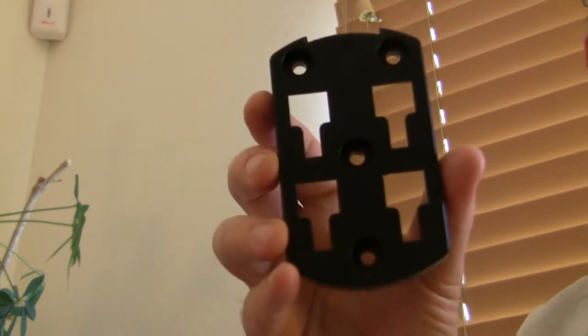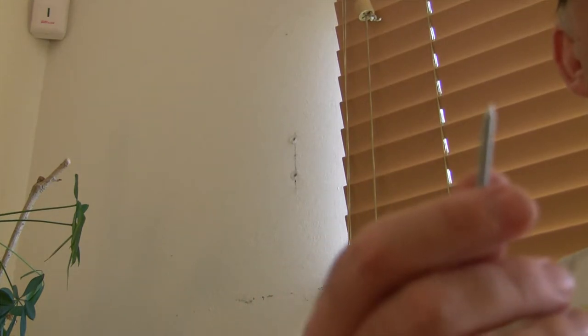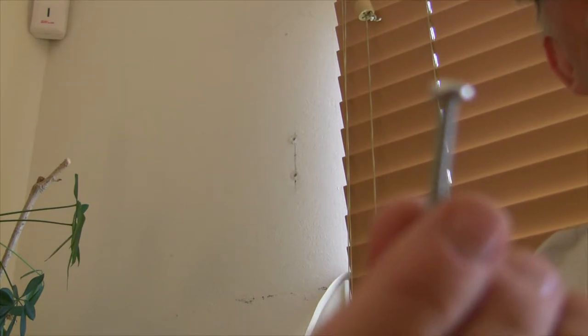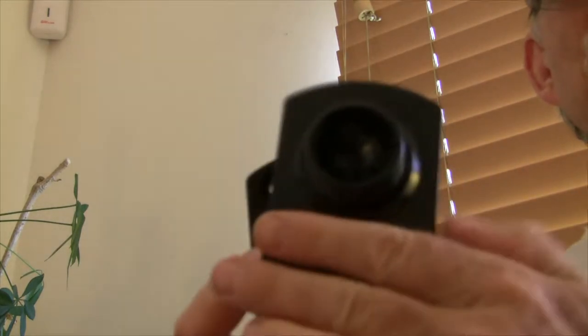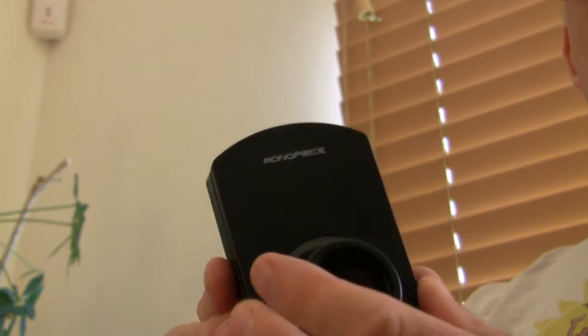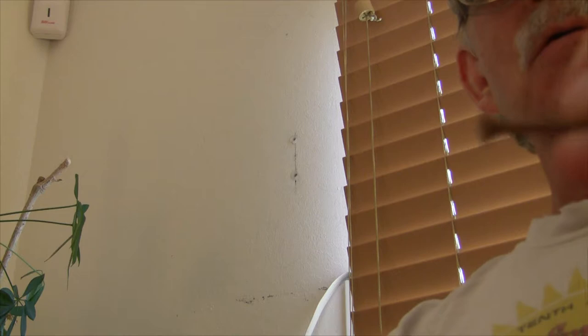When we put on this bracket, we're going to have to use the wall anchors that came with the Monoprice bracket. The height speakers I installed - I tried using the screws that came with the bracket to go into the wood, because there was wood where those were installed. And if you didn't get this exactly perfectly aligned, then the bracket that actually holds the speaker would not slide over the mount on the wall properly. So what I did instead was I used these fluted - I guess that's called a bugle - bugle screws, like you'd use for decks.